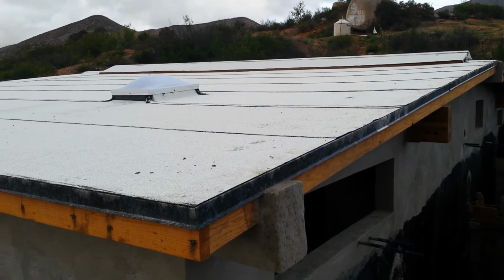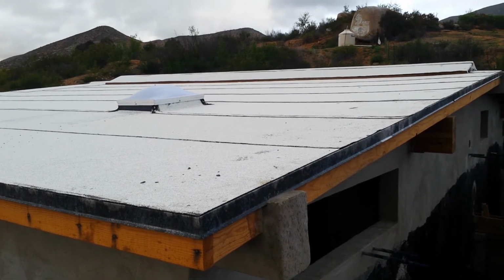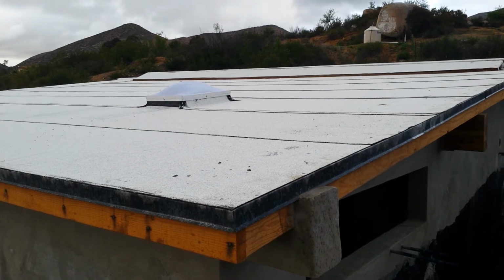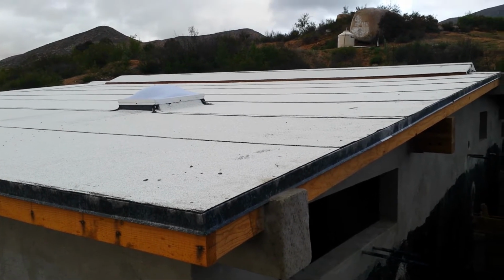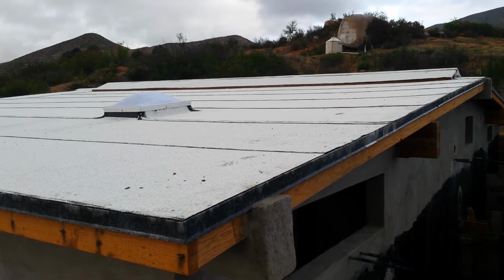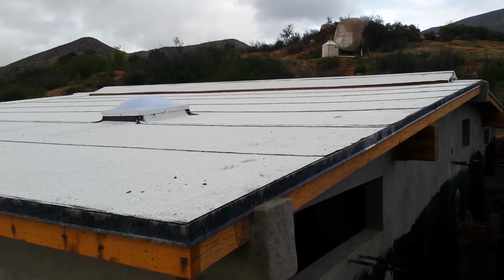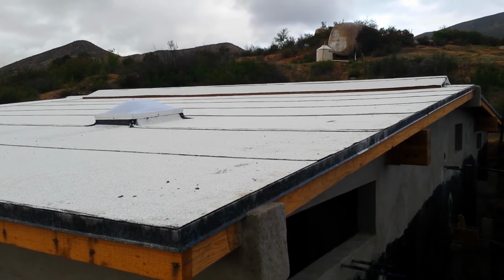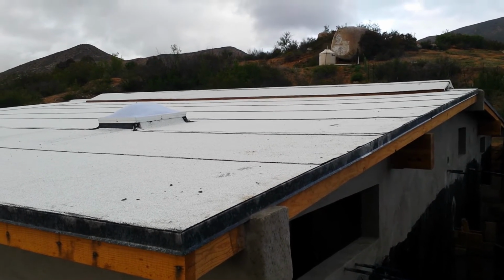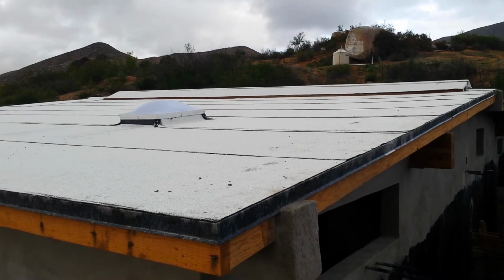It has a 3/4 inch gap, and then it has a steel mesh. The steel mesh we put in there so that no birds or mice or bugs or insects go up inside underneath that little cap. And there's another steel mesh sitting on the flat inside there, where the roofing is actually open to the air vent that we created.